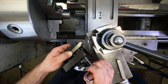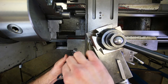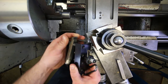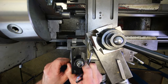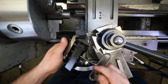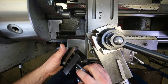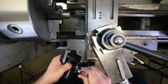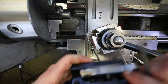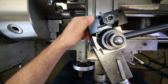You need at least two set screws tightened, because if only one is tight it creates a pivot point and the tool won't be firmly fixed. We need at least two points — you can use more for extra tightness. I'll need to remove this one and flip it around due to orientation in the lathe, but the principle holds.